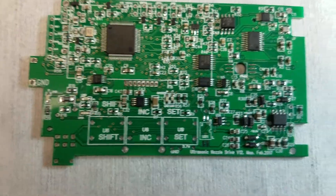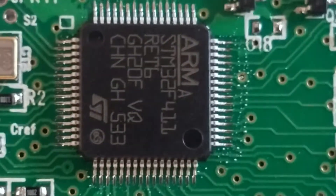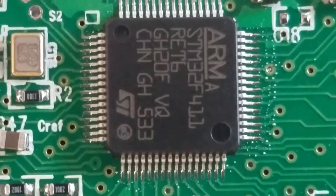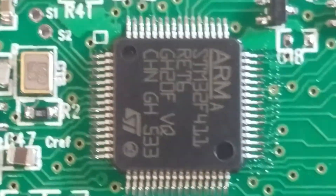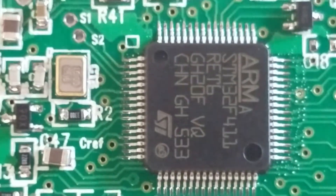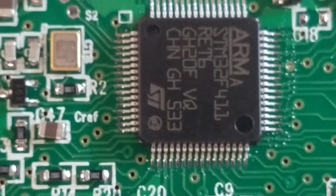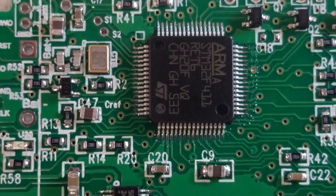Then you can check the components. You can see the chip — right side, all the pins — the solder paste has already melted and you don't see any short circuit between pins. But of course, you have to check the pins one by one on the microscope to make sure everything is right.